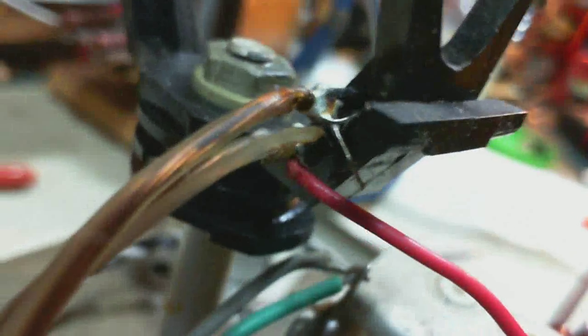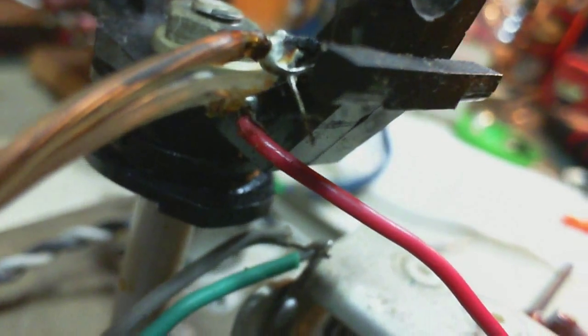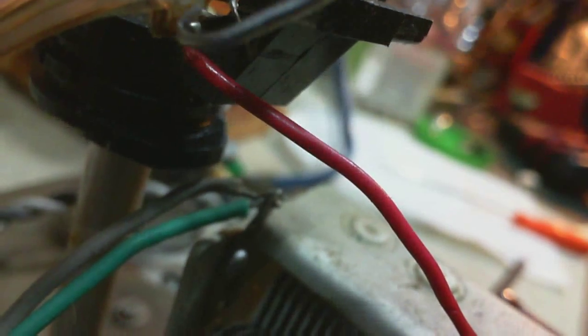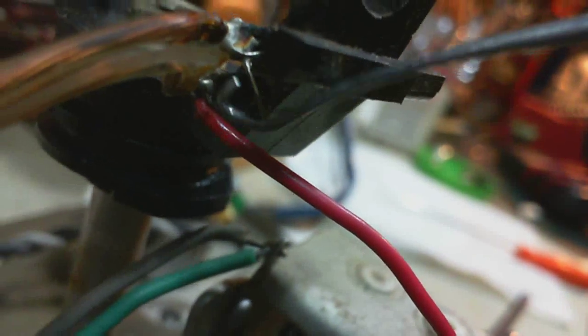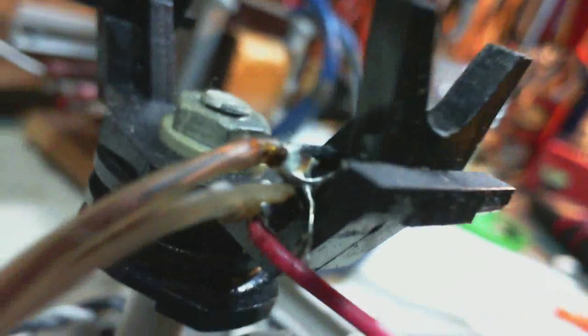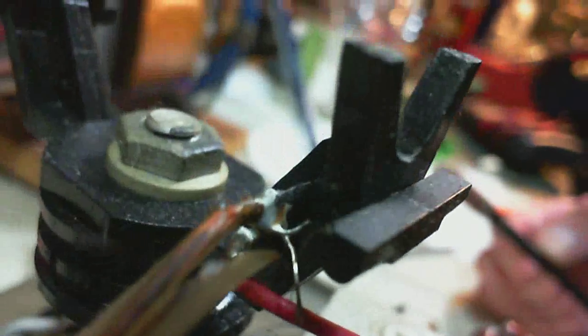Let's look at the piece of wire that's hanging out there. I'd say it has a frayed end. Take a look with my magnifying glass and see. Yeah, there's definitely frayed. Definitely frayed. So that's the frayed end, and then the other end, which has the solder on it, must have broke right off at the connector. And that's why we can't see any wires sticking out. Oh! Wait a minute.